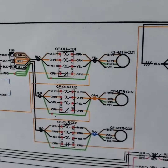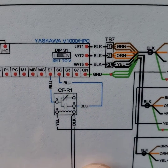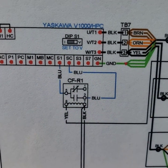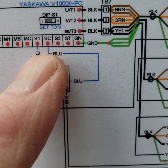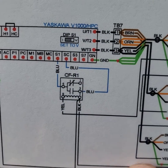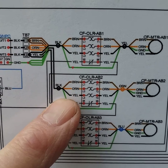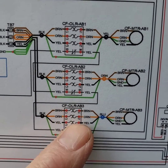There are two banks of overloads and there are the motors. Contact closure right here on this relay between SC and S1 tells the drive to start up. If you had a heat pump, you would have an additional IceCube relay right here that would close contact between SC and S7 to send the drive to full speed. This is not a heat pump here. The command for that relay comes through all of these overloads — it's in series through the aux contacts on the overloads.